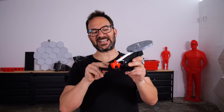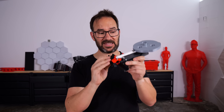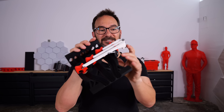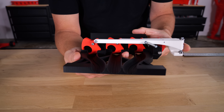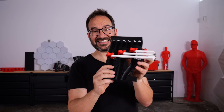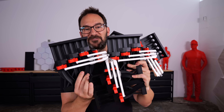Now let's get back to marble selection. One cam disc, two input channels, one output channel — one marble selector is good enough for one marble out of 15. For each row we need three of these, more or less something like this. But again, this is just for one row. We need five rows.